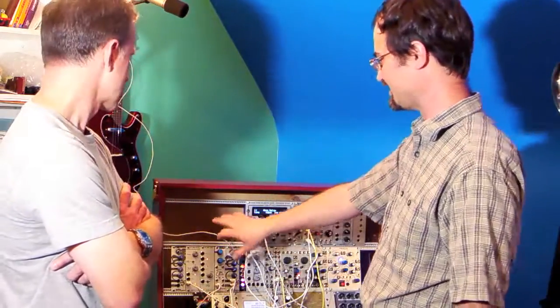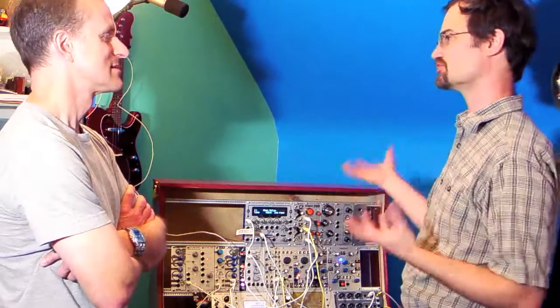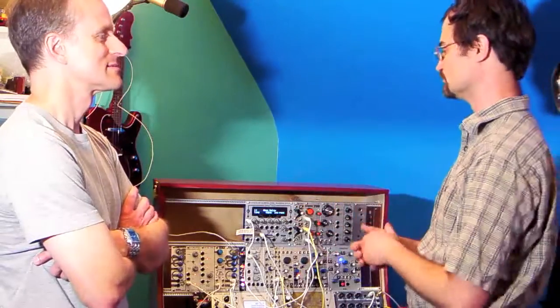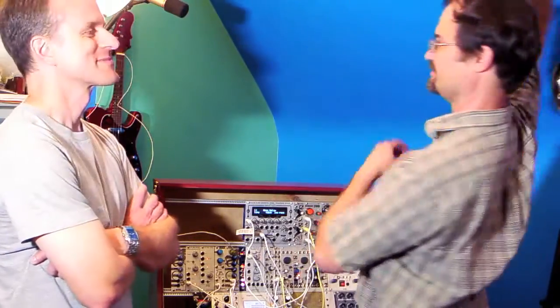Right. Now this one's just a handmade one I have here in my studio, but the RF Nomad ships with a 5-foot long antenna, and this is kind of a starter antenna. A lot of people do have good success with that. Just kind of depends on your location and so forth. If you do live in an area that has a little bit more difficult reception, we do offer a 25-foot long antenna. Wow. And if you get one of those, I kind of recommend you run that up along the wall, maybe tape it around the ceiling or something like that, and get as high up off the ground as you can and away from metal objects.